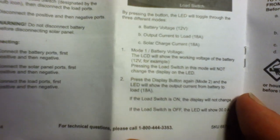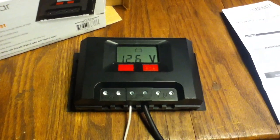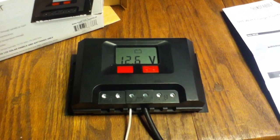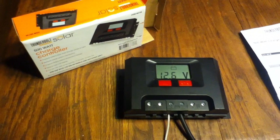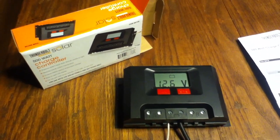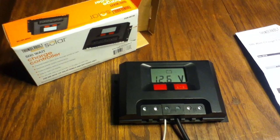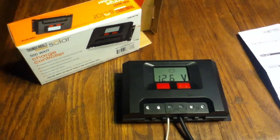I don't know exactly how they want to deal with that, but when I see 18 amps listed throughout, I don't think I'd want to be trying to pump 500 watts of panel power through this thing. The Harbor Freight panels are such low-powered panels that maybe they're thinking this is the top unit for their lineup — and you would need a lot of Harbor Freight panels before you're getting to 18 amps. Given that the retail price is around $80, with coupon pricing rarely getting below $60, you've got to look at what you're getting for the money.